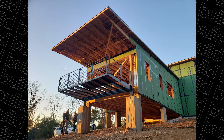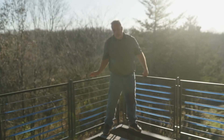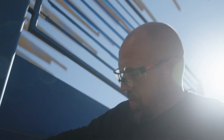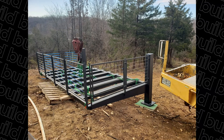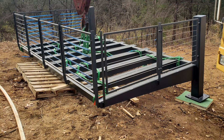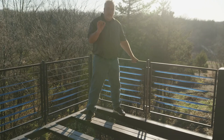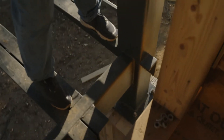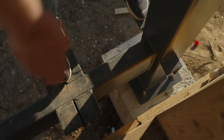So basically it's a whole series of blind fasteners. On the upper rail, we did a one-inch square tube. We have stainless steel rods, and this is going to get finished with a nice wood handrail to match the floor decking. Emmett the steel fabricator made all of our support bars and balusters. He did a beautiful job leaving the corner open just as I wanted, and it still maintains that four inches for code. The building science key to this deck is right here — no part of this deck connects to the house whatsoever.